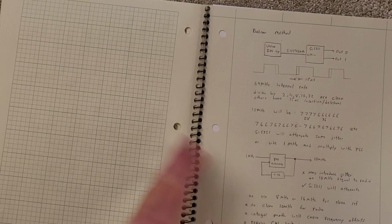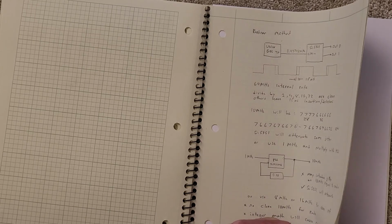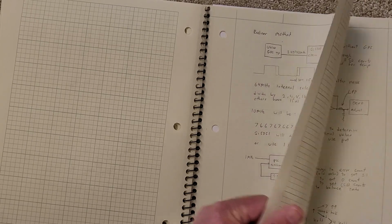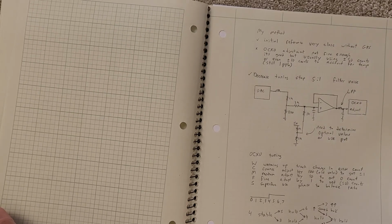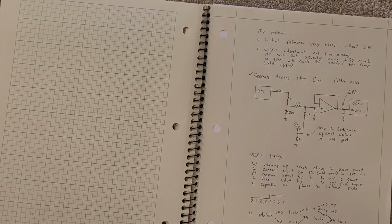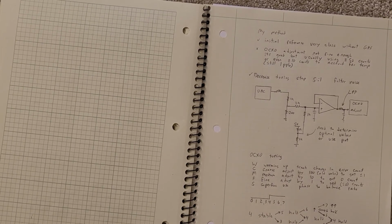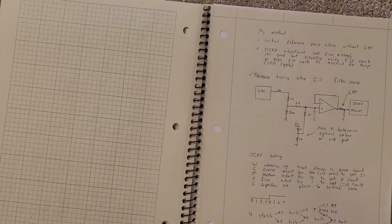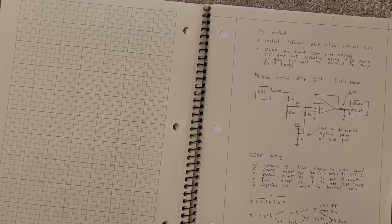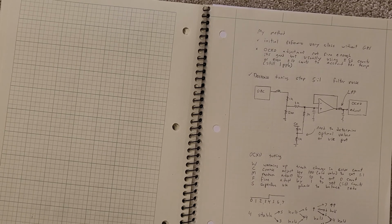The other thing, so I'm trying to make my system better, and the way I'm doing that is by two things. One of them is, okay, I didn't realize I had a pause function, so that's going to come in handy in the future. So what I want to do is actually, when I'm tuning the system, I usually find that I'm jogging between two values, and so I can get very, very close to being exact, but I want some more granularity. And so one of the things is right now the DAC count, one DAC count is 1 millivolt, and that's the finest I can go.